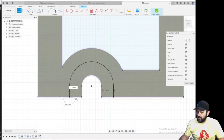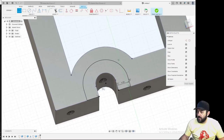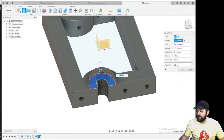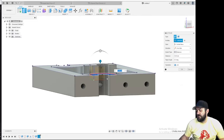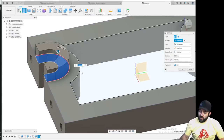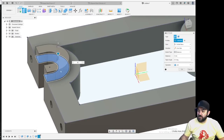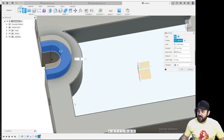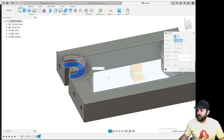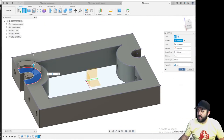I am going to clean those up. Then I'm going to hit E and we're going to drag that up like 5 millimeter. How's that smell? Actually, let's go 4 millimeters. And that is specifically because we did an 8 millimeter offset before, like for this border. So if I do a 4 here, that leaves me 4 millimeters out here still. I could do a nice chamfer or a fillet and everything will blend perfectly to the outside. So let's go 4. Now we didn't do it on the other side. So we can hit okay.